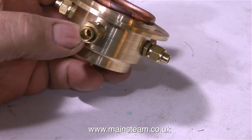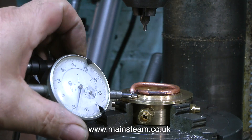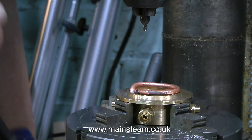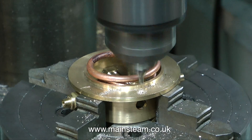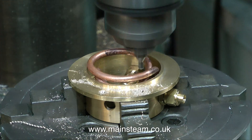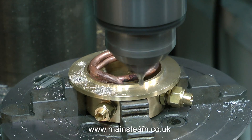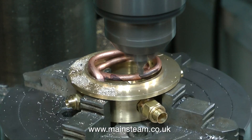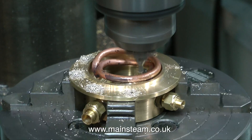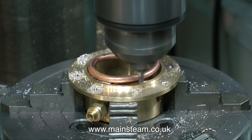This is the chimney mount that holds the super heater and I need to drill some holes around the flange so that I can bolt it onto the top cap of the boiler. A quick check for concentricity with the DTI and then it's time to spot the holes around the edge of the flange. Eight holes should be okay, so I'm using 45 as the number, and multiples of 45 give me eight equidistantly centred holes around the flange.